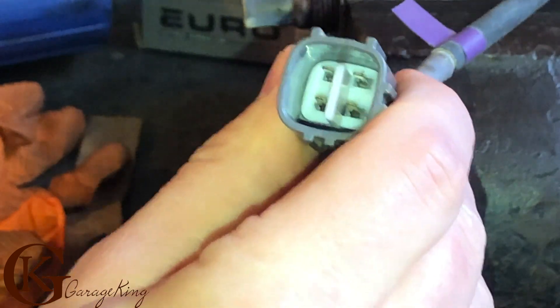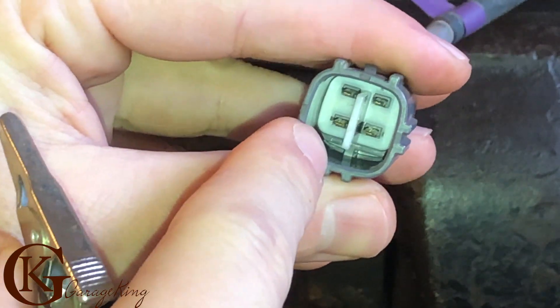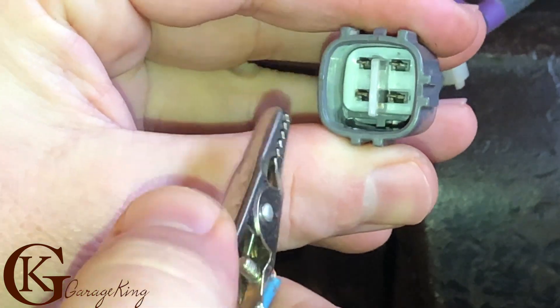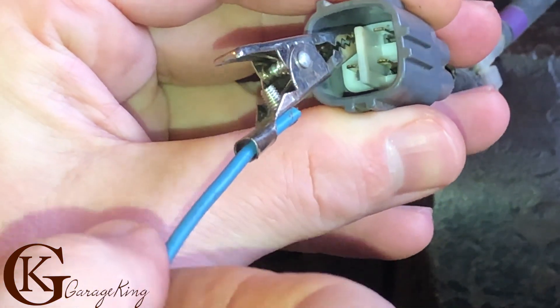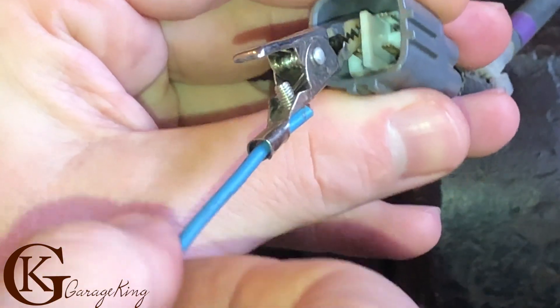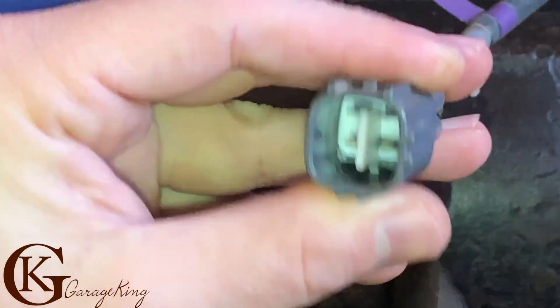Now, if you don't have those connectors and want to try with an alligator clip, it's not the easiest thing to do. Here's an alligator clip and here's the size of it. Technically you could connect an alligator clip — you can see it's hanging on and not touching anything — but you've got to be careful because you're getting really close. I can actually feel it touch there, as long as I'm not touching the body of the connector.